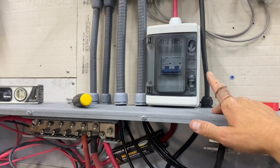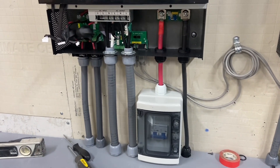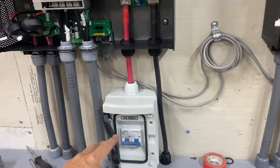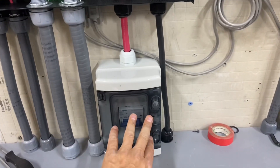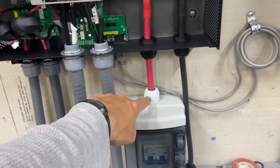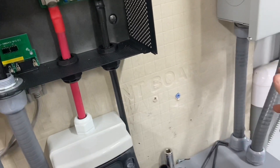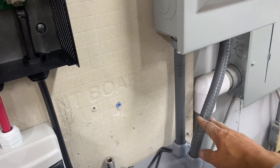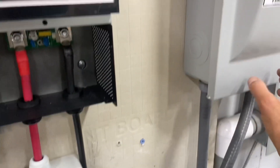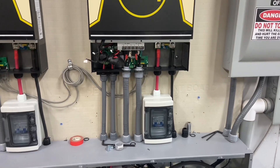I went with the Nader Breakers from Signature Solar. They kind of made it a little bit of a cleaner setup here at the end. They're really cool little cabinets. I used flex conduit because that's what I had originally, and I could have actually done some stretches here too. But you always pick at stuff later. I could have done an inch and a half, just one here and put everything into my disconnect from there. But instead I ran two of them because that's what I had before.